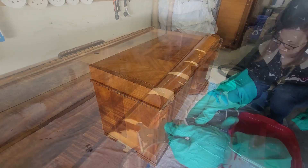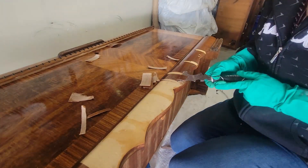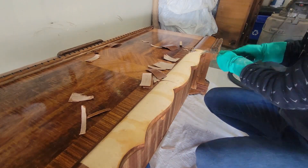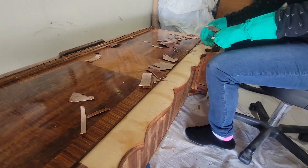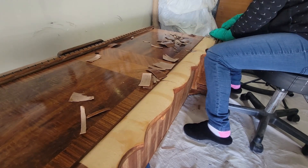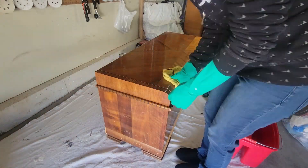The front of this chest actually peeled quite easily — the sides not as much — so I did have to fill those in. But I figured it would save me time to just peel off the veneer instead of trying to patch and sand it, and it definitely saved me a lot of time. Once I got all of that veneer removed, I cleaned it just in case there was any residual glue left behind, then wiped it clean with some clean water.